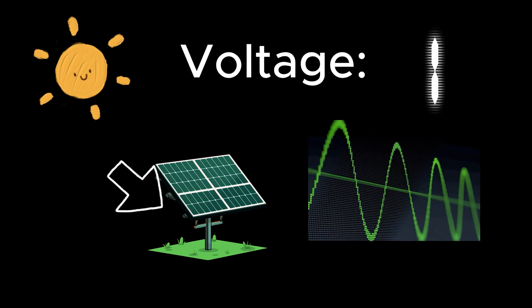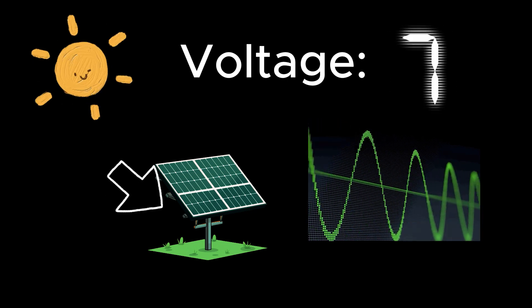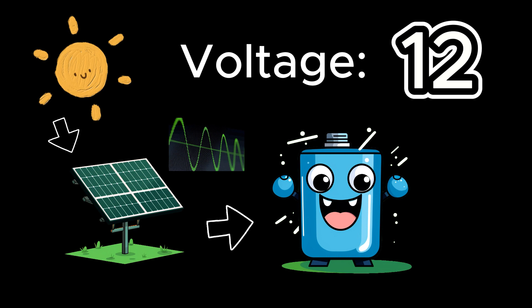Why do I need supercapacitors if I have solar panels? You see, solar panels can go from zero volts up to 24 volts — some can go higher — but the voltage changes depending on what's going on in the sky, making it difficult to get a steady voltage to power whatever item you want. The supercapacitors are used to clean that voltage. If you want me to make a video explaining step by step how to do the whole setup — how to connect everything, how the solar panel, charge controller, and supercapacitor work together — leave a comment on this video, and if we can get over a hundred likes, I will make that video for you.